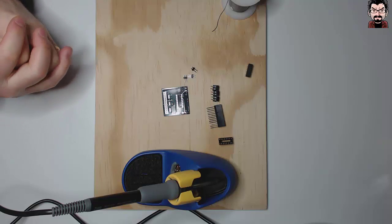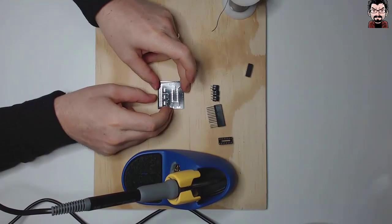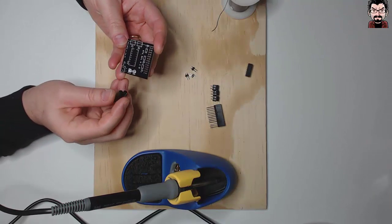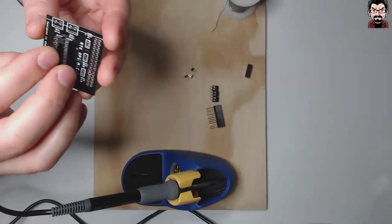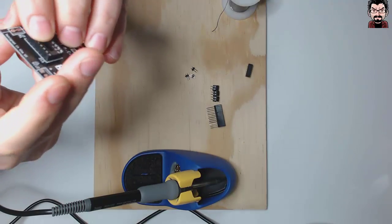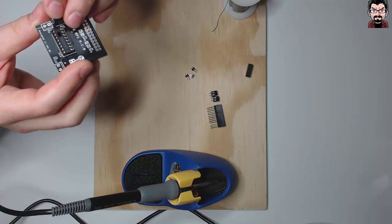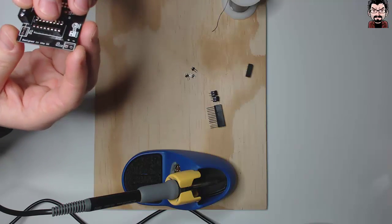And without further ado, let's fire up our soldering iron and start building up the board. I should be better off following Ryan's instructions, but in any case it is good practice to start by installing the elements which are less tall first, and then progress with taller elements as you go by. It is otherwise difficult to weld anything on the board.